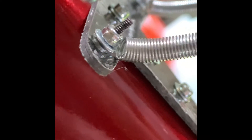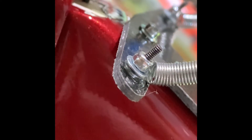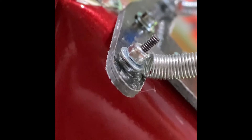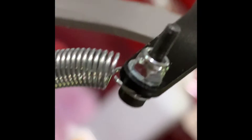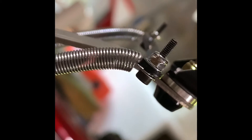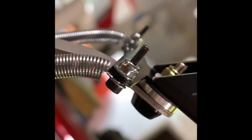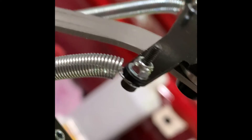The spring is in between the washers. It's a two-millimeter washer up against the tail wheel bracket, and then there's a two-and-a-half millimeter washer up against the lock nut. In between those washers is the spring. This allows the spring to move freely. The other side is similar: a two-millimeter screw with a socket head, then a washer, and the spring sits between the washer and the tiller arm of the tail wheel, with a lock nut.